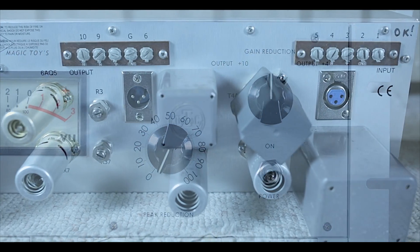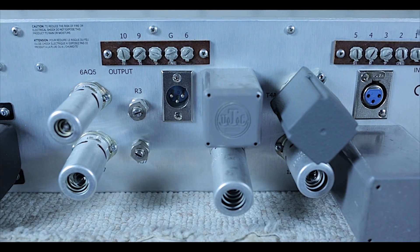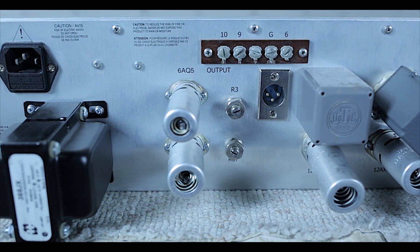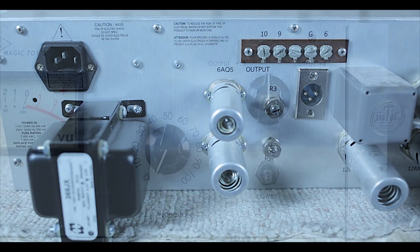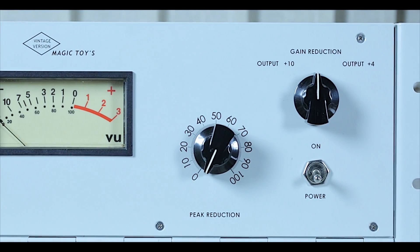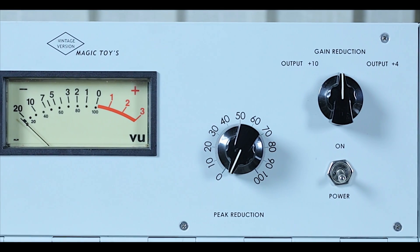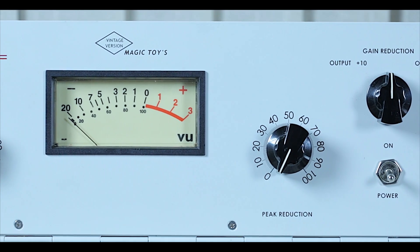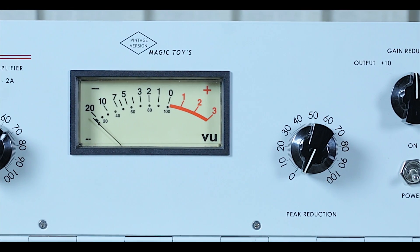I used the T4B OptoCell by IGS with an average release of 2.7 seconds. Old UREI OptoCells had a release of 3.5 to 4 seconds, by Clairex CL505L and CL705. Those components are no longer available on the market.